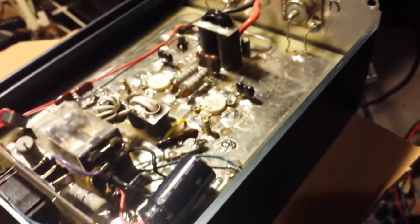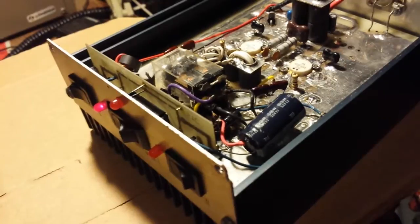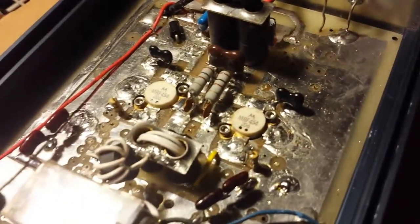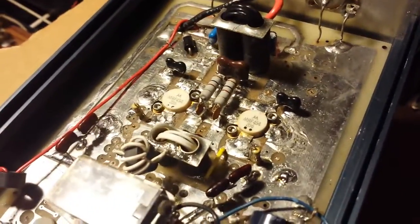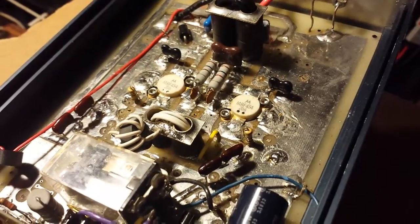Let's see what she's going to do. I'm not expecting big watts. Two 454s is considered more of a high drive amp — I'm not going to be driving this amp hard right now. You can use your imagination: if you drive it harder of course you're going to get more watts. Being two MRF 454s they can take a little drive, so this would make a good little amp for an export. Hit it with 40-50 watts, no problem.